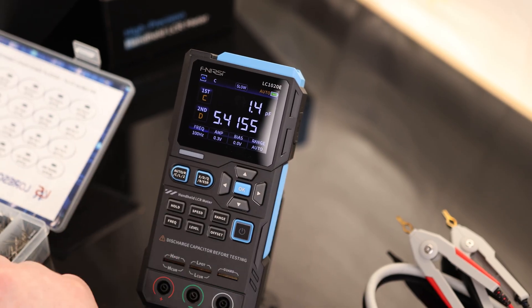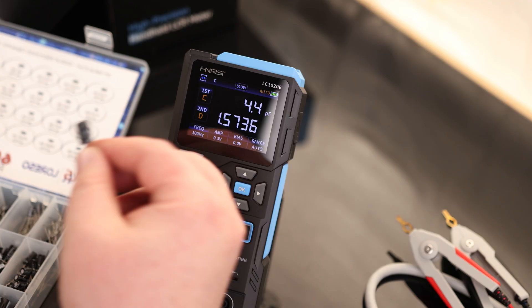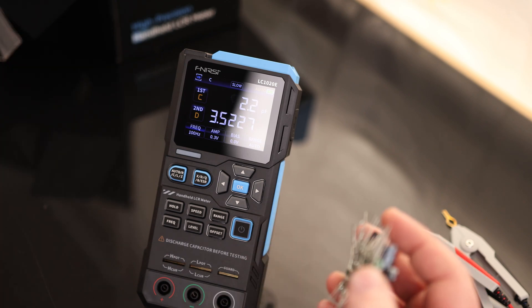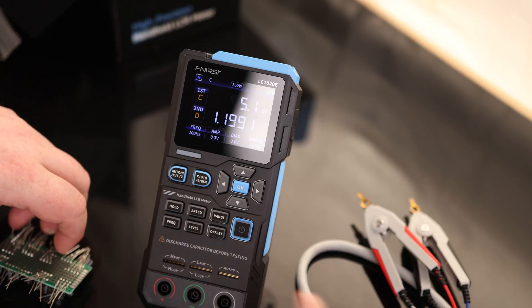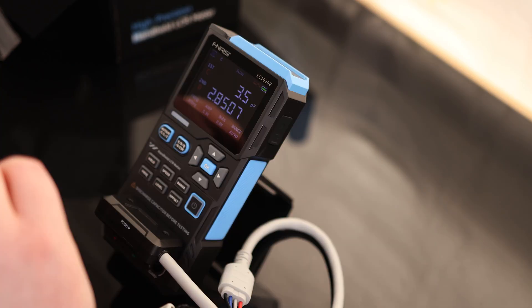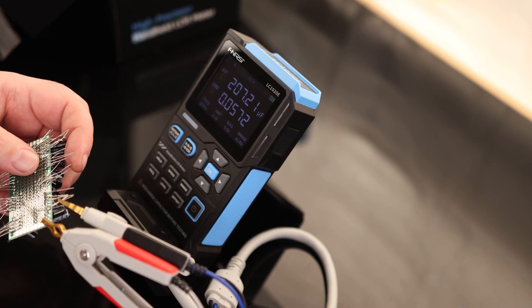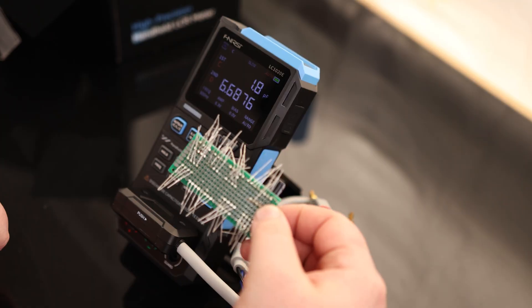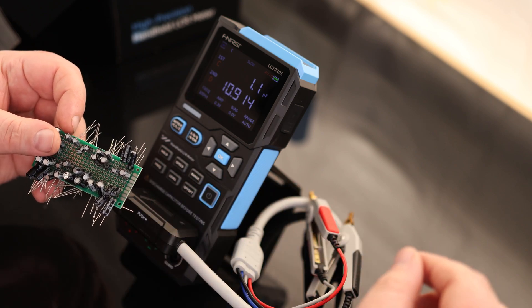Let's go to capacitance. These are not super accurate capacitors, but let's take a look anyway. This is a 330 microfarad capacitor — reading 310, which is definitely within the 10% tolerance. One of the really cool things about an LCR meter is that you can actually check components while they're in circuit. We've got a 220 microfarad capacitor right here — reading 207. If you need to check a capacitor and don't have the ability to pull it out of the circuit, an LCR meter really is the best thing for that. You can often find and identify a bad capacitor that isn't even showing that it's blown or leaking.